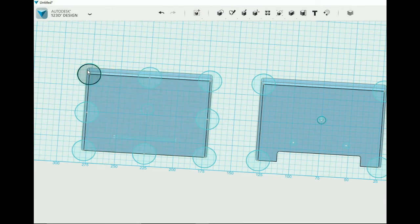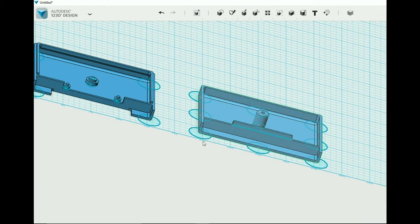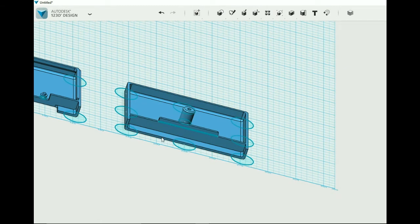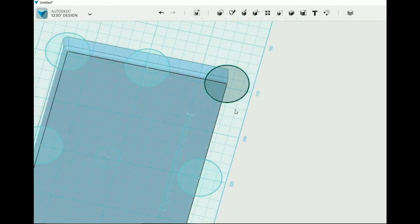By putting these circles here, I can actually extrude these right before I get ready to generate my STL files, and it will allow me to have a little flat disk of material that's connected to the main portion of the STL itself. And what that does is it allows the part to have kind of a hand that I can grab a hold of the build plate with. And I'll just kind of show you what I'm talking about here. I take this